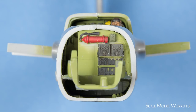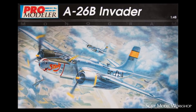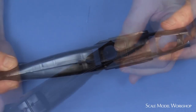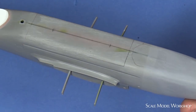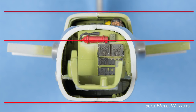But what happens when we get a kit with problems? For instance, like this 1/48-scale Revell Monogram A26 Invader. The fuselage of this kit has minimal integrity due to the amount of cutouts. There's a great amount of flex and twist to each individual half, as well as when the two halves are brought together. No matter how carefully you get things together, you're left with a fair amount of filling. In a perfect world, both fuselage halves would be mirror images of each other. But alas, the pattern makers came up a bit short on this kit. There's a definite lack of parallelism from top to bottom when viewed from the front, and the wing supports are woefully out of kilter.